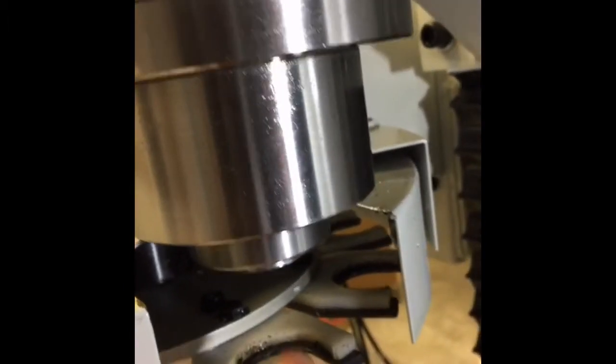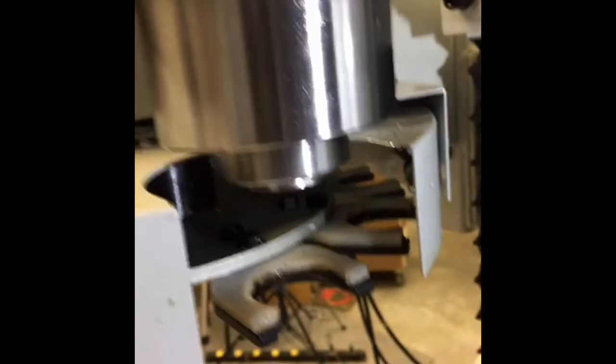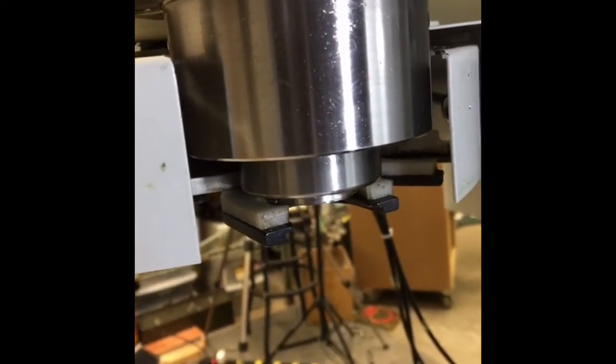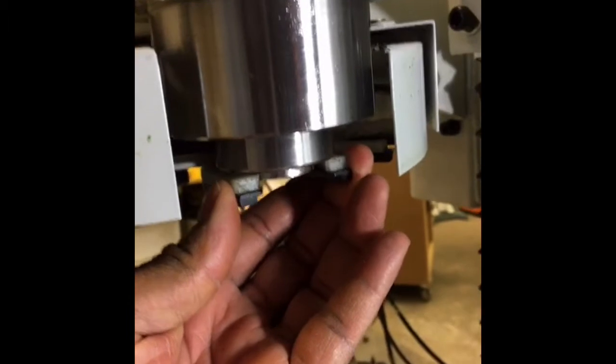In each one of these positions you've got two nylon bolts that you have to adjust, and you raise and lower the spindle of the mill until it's just above the plastic part of the fork. There should be a little bit of backlash in there but it should clear all the parts. In this case you can see that this one does clear. You have to set that for all 10 of the parts of the tool changer, which is what we just did. Hopefully that should resolve most of our issues, and that will allow us to put the enclosure around this thing.